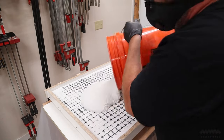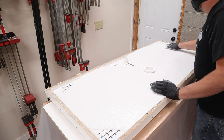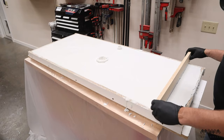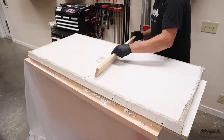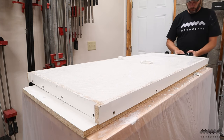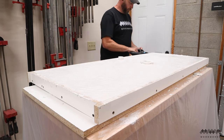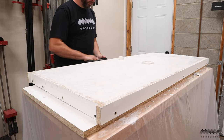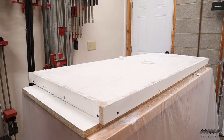When I calculated out how much concrete I'd need, it worked out to almost exactly two 50-pound bags — and that was dead on. I scraped every last bit from the bucket and it was just enough to screed it nice and even with the top of the mold. I then vibrated the heck out of it to get the air bubbles up using my Theragun — one of those tools that's really good at what it was designed for, but even better at something it was never intended to do. I walked around vibrating all the edges for about 20 minutes and let it cure for about 48 hours.